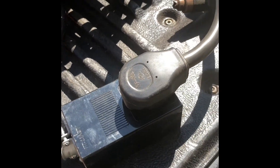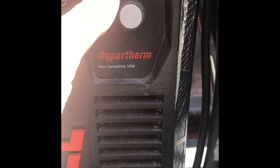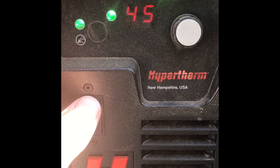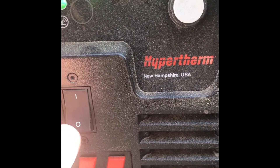And then you would have plasma capabilities on your mobile unit. Alright, so we have it plugged up to the Ranger mobile power unit. As soon as I flip this switch here to power, you'll see the light come on and the power come up. But you'll also hear the engine drive machine jump to a high idle. There's a flashing light — that means we don't have enough compressed air to the machine. When I'm running the plasma cutter off my mobile unit, I always turn that selector to high idle. I don't let it jump up and down between cuts — that runs the circuit dry and it's going to burn up a circuit board too often.